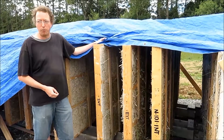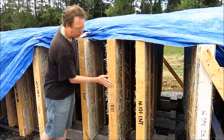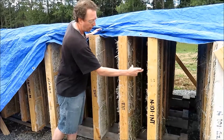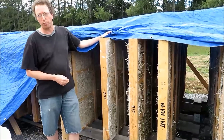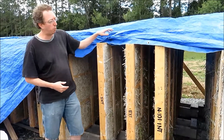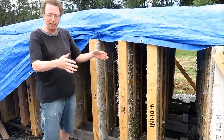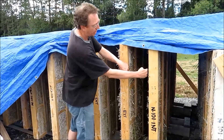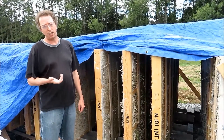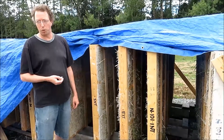The mass actually does a lot for the comfort inside the building. Now, we have an exterior panel and an interior panel - this is kind of the whole wall. In the core we put some fiberboard - it's like a blanket in the middle. It helps us with formwork so when we move panels into place they go in very easily, and it also creates a nice buffer in the middle of our wall system. That tends to give us a continuous R-value of about R12 once we're done.